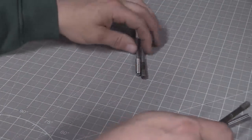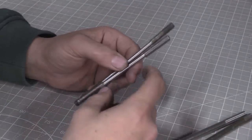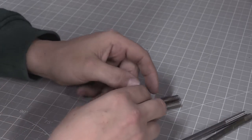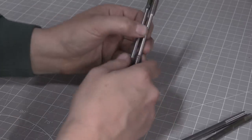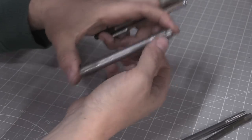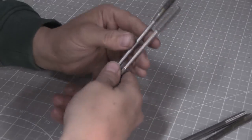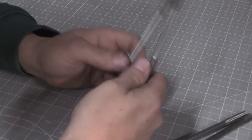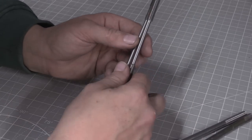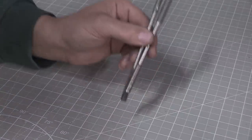That's why you have to have a standard. Now, these aren't being pulled to a standard. These are just going to be pulled because they're actually shorter. Not that it matters. It's just the test you put in. You want to make sure that all your test pieces are the same. Now, if you're going to an international standard, you make sure that all your pieces are the same length, same thread count, same width, same radius, same everything. With this, we're just comparing these two in isolation, right? We don't care about the world standards. We just care about what the numbers are for these two individual ones as a direct comparison to each other. So I'm not doing it to any standards, so to speak, obviously, because they're the wrong length.